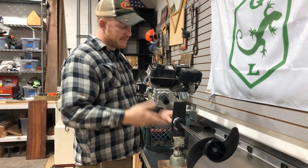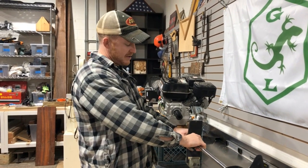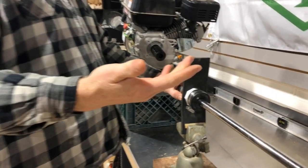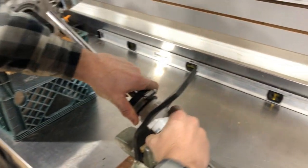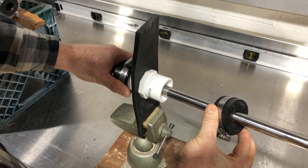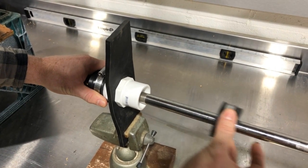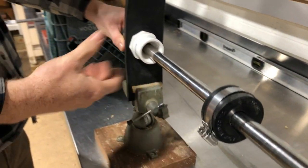but I'm really proud of my ability to go to Home Depot, my personal favorite hardware store, not sponsored, just personal favorite. There's no story there. Went to Home Depot, spent, I don't know, $8, $9, bought a couple plumbing fittings. We'll pull this apart here. So this first piece is a 1.5 inch Fernco cap. Ordinarily it wouldn't have a hole in it, but I drilled a 3/4 inch hole through it. So that cap comes back, and that's what's sealing the prop shaft to this little through wall fitting.